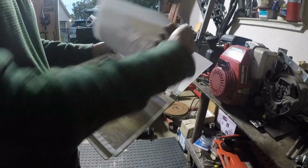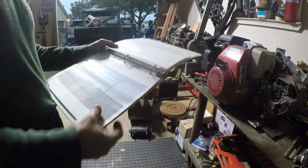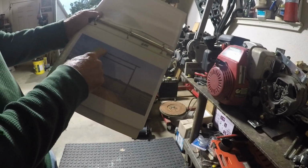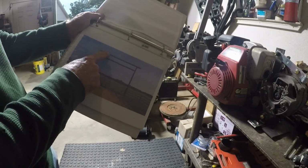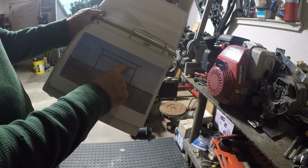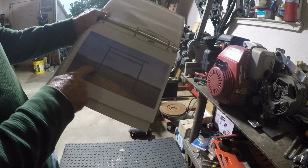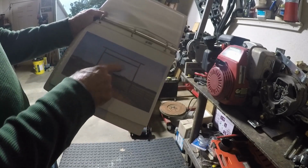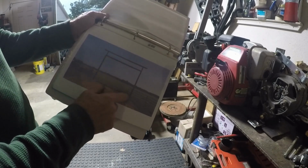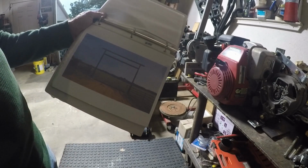As a bridge I built. There it is. So this thing's about 20 some, I think 22 feet tall or something. Maybe not. This, I know this is like 15 feet from the bottom pipe to the top of the cattle guard. I built all this entrance, cut them. I had an old scissor lift. I actually put that on the scissor lift. I already had them saddled and used it to raise that up and lock it in while I welded it.